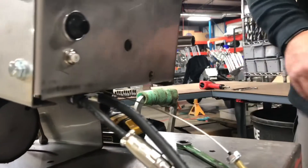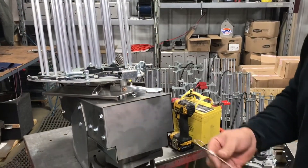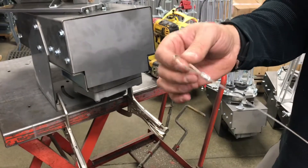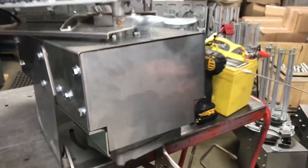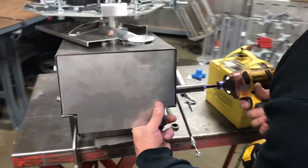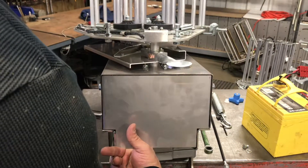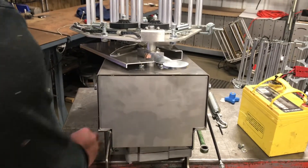Now we need to get to the front of the cable where the loop is. To do that we need to open the front cap of the machine. The loop is attached around the motor crank, and to get to that portion we need to take out the four bolts that hold this front cap on. It takes a half-inch wrench — in my case I'm using an impact with a half-inch socket — and I'm just going to loosen and remove this front cap.